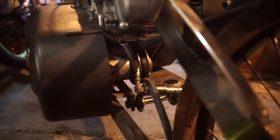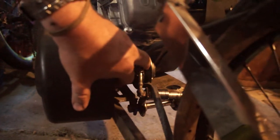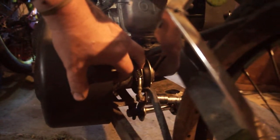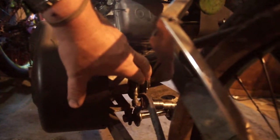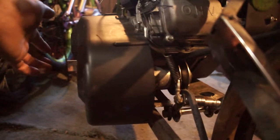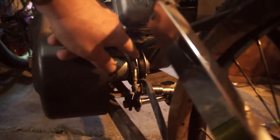Back here on the back of the CVT — I'm not calling it a torque converter — I have this pulley back here. This side of it is just welded to the shaft. This side can unscrew and get wider or smaller. So effectively I can adjust the gear ratio in this, similar to the way a CVT works, except this is just set it and then it stays.